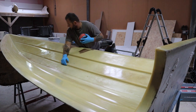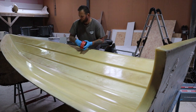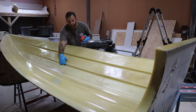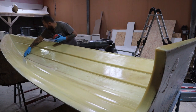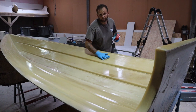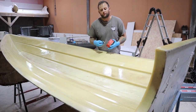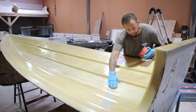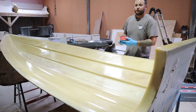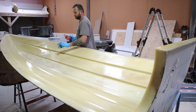Okay, so releasing these, got to make sure there's definitely enough wax in these corners. Because this is a complex shape, there's surface tension created on a deep chine, and that's where the mould is most likely to grip. Big flat surfaces are pretty easy to break off. These tight complex corners are more difficult. The more complicated a shape, the more likely it is to want to stay in the mould and not come out. It's all about creating that pressure when we go to release, to get in that flange and release it from the boat itself.